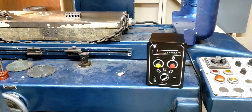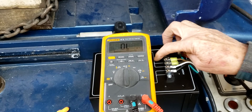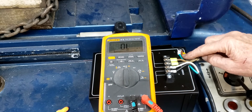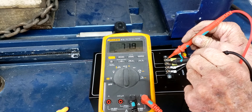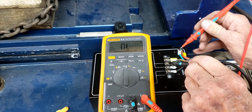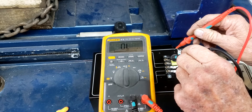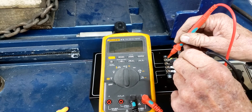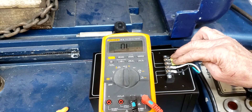I'm happy with it - just something I found on eBay. To determine which leads coming from the magnet go onto the mag chuck controller, I took resistance readings across each of the three leads, each pair. What I got was 72 ohms - that tells me you're looking through a coil. Then to ground we're up in the kilohms on both those leads. When this was disconnected from the box I was reading infinite resistance, so that tells me these two leads are the coil for the magnet. This thing comes with its own cord - you hook up AC, your DC going to your magnet, and your ground.